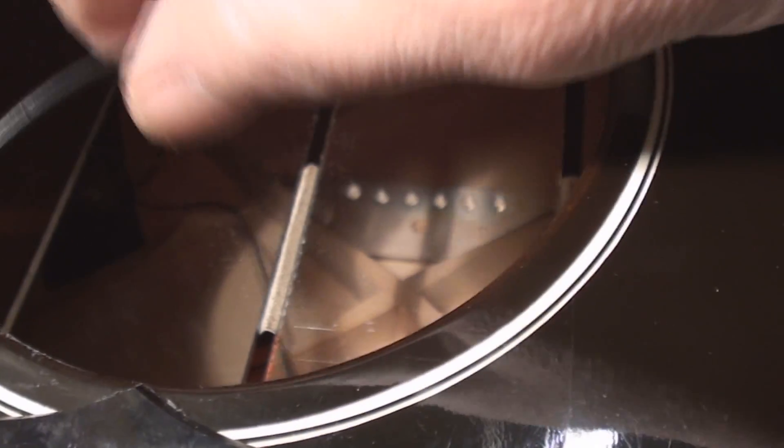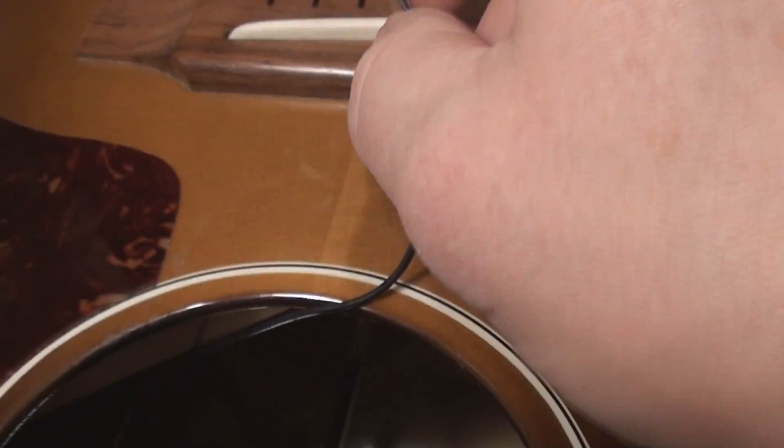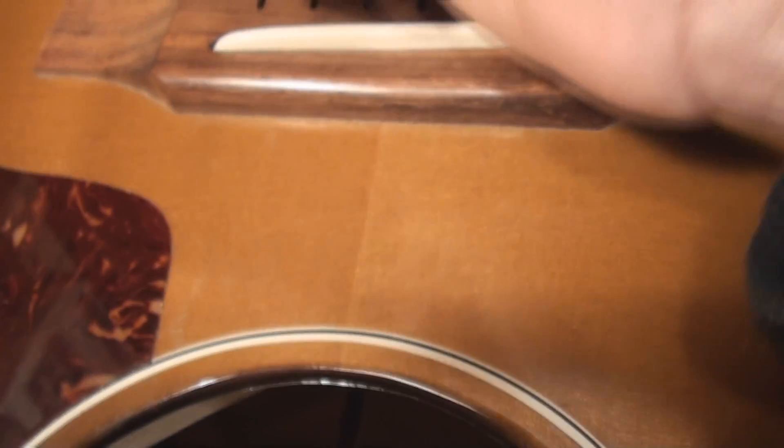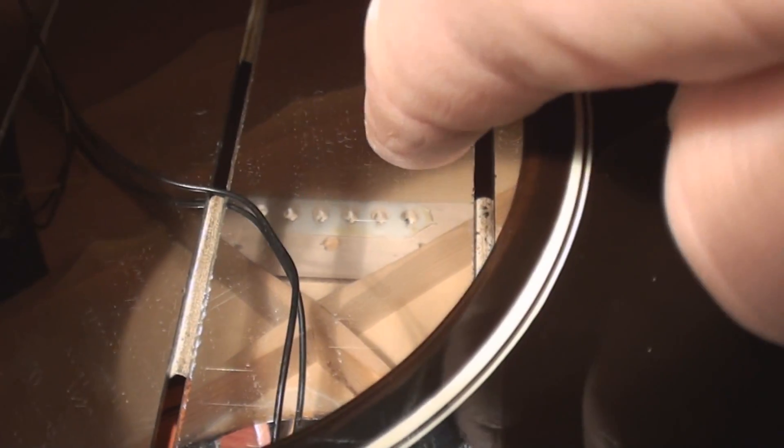Well, this is what I'm figuring — that's a bridge ground. But there's no metal for the strings to attach to. I'm sure there was some sort of a brass strip or grounding strip that was in place in there for the strings to touch, and this wire was connected to it. It might not seem important, but it would help you not get electrocuted. And also, when you put your hands on the strings, you're going to hear noise. This is a bridge ground that doesn't exist because the piece has been yanked out of there. Let's see if we can figure it out.